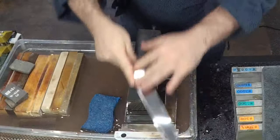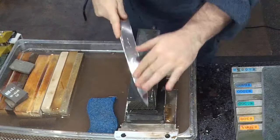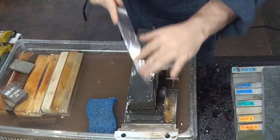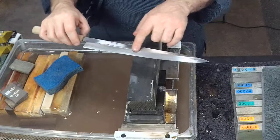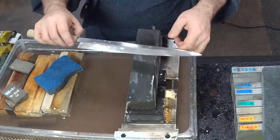It's a hard stone with a darker bluish-greenish-gray color. It feels infinitely smoother compared to the Monzento work. Parts of the blade are starting to polish, so it's not leaving as even a contrast — there's streaking around the curve and splotchy sections where it's starting to mirror-polish. The scratch pattern is significantly more refined than the previous stones. It's probably in the 5–6k grit range.